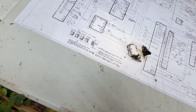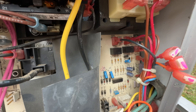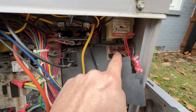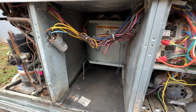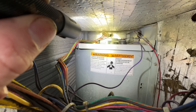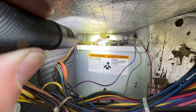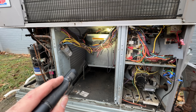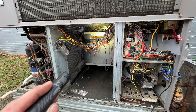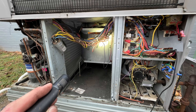After checking the schematic and looking at all the wiring diagrams for the blower motor on the low voltage side, I checked the board and I'm not getting any voltage coming out of the board. I actually disconnected each wire that goes over to the motor. I disconnected the low voltage plug on the motor and it's still running. That is a sign that the module on that motor is bad, because we're not even getting a 24-volt signal to the motor and it's running. So it looks like I need to find a new motor.